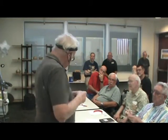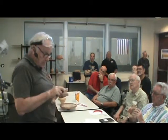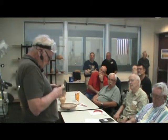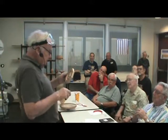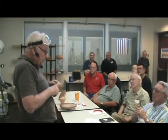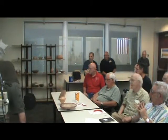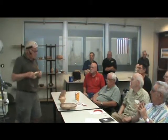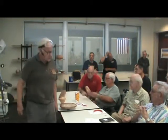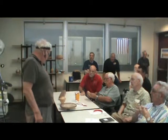How can I fix that? Well, I've got a 12-inch sander with a table that's nice and square. You just take that ring on the sander and it'll fit. But I don't like to do that, because after you do that this is no longer a circle — it's now an oval. For some things it's okay and for some things it isn't. I use usually eight or 16 sides. This is off of my 16-sided jig right off the saw, and that's one I used when I was really zeroing in my sled.